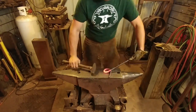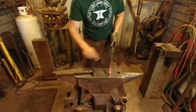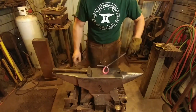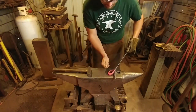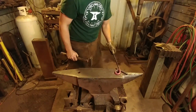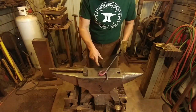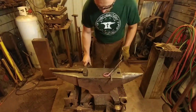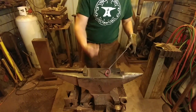It's a really great way of practicing your hammer control and where to hit and move the metal. Now we're going to heat this piece right up in here, wrap it around and thread it through the hole on the hardy hole and tuck it. Then we'll go with a rawhide mallet, tighten everything up, and then we'll move on to the actual base that's going to turn this into a nautical sculpture.